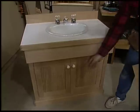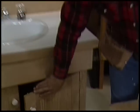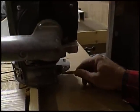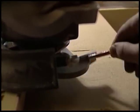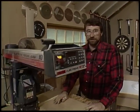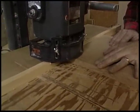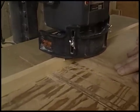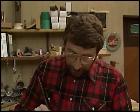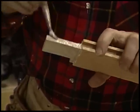Let's take another look at our dry sink and see the detail on the inside of the door again — it's a raised panel. To cut that, I'm going to use my radial arm saw with a molding head cutter mounted in place of the regular saw blade. It's a heavy wheel with three cutters which, spinning around, will remove material. I'm going to do the raised panel in two passes, especially with this hard oak — it's too much material to take out at once. Always doing the end grain first to minimize splintering.